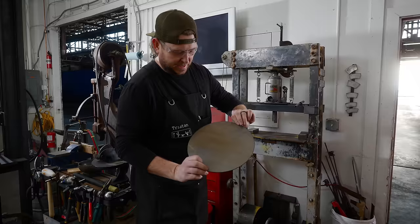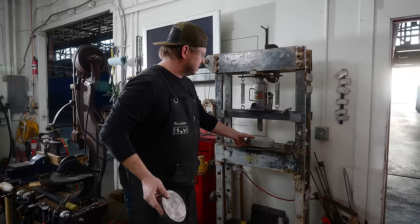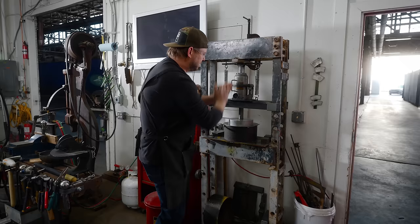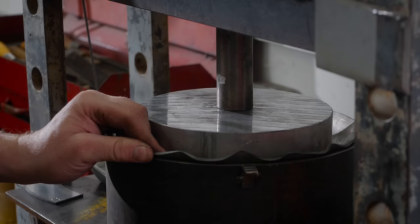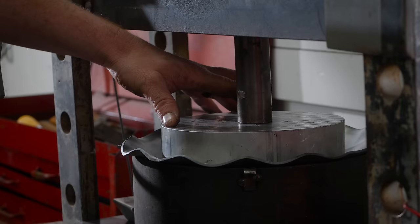We've cut these out with a plasma cutter to a specific size. This is going to be a 10-inch round skillet, so we're going to put it on a blank from below — that's going to be the cooking surface size when the skillet is finished. We need the bottom to press it into, so we set this on the bottom. You can see the steel starting to go down where that puck is in the middle. Right before it pops down into the bottom is when we want to stop — that means we've reached our full depth. There we have the beginnings of a 10-inch round skillet.